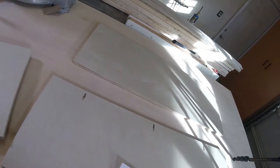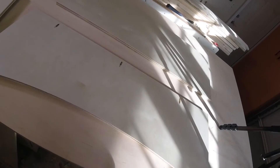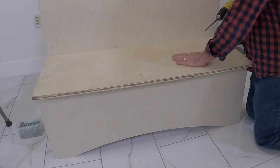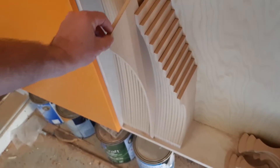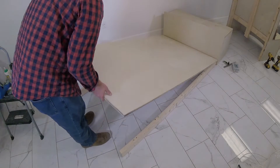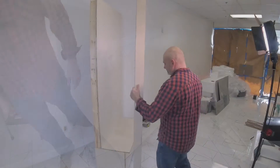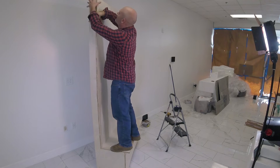Moving up to the top piece — the seat is 42 inches wide by 16 and three-quarters inches from front to back. The front has a radius, which is completely optional, but if you wanted to add it, you would start at 4 inches and measure in from either side, and as the radius starts at that corner, it raises up 3 inches. You can do that with a bow jig, a pattern template, or even just roughing it with a jigsaw. We've also included pocket holes along the top of the front piece to help secure the seat. The seat back is 42 inches wide and 74 inches high, and the side pieces on either side of the seat back are 3 and a half inches wide and also 74 inches long — we'll cut those to length later.